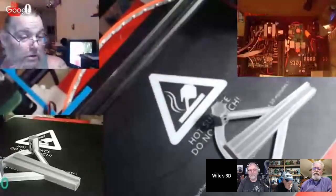Nice. Now, Richard, let's talk about the BL Touch for a second. Yep. I have one here in the drawer that I've been thinking about messing around with. The thing that I don't like about it is the leads that are on the unit itself are short. And it always seems like you have to monkey with making additional connections. I'll make it easy on you. Go to your local hobby shop and buy a servo extension kit. Okay. And they work perfectly. They're exactly what it is, a servo extension kit. They're the exact same colored wires, the whole 9 yards. And how long are they? Usually about 1 meter to 1.5 meters. Okay. Well, all right. That makes sense.